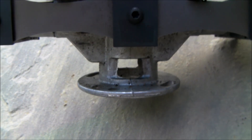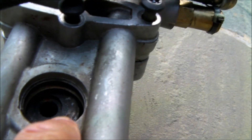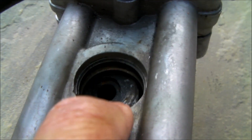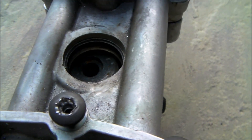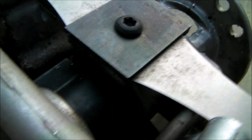This happens to be a vertical shaft down application. Let's call this end of the pump the drive end — the engine crankshaft comes through here — and let's call the other end the opposite drive end. It has two bearings which are prone to failure. One right here, and you can see mine is completely missing. The ball bearing is completely disintegrated: the balls fell out, the cage failed, and the inner race of the bearing completely fell out. There is another bearing you can't see right under this piece here, and it's mounted in a block. That block replacement with the bearing is still available.